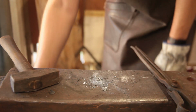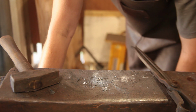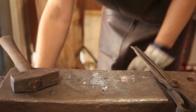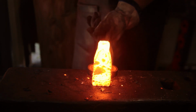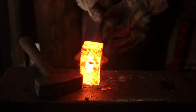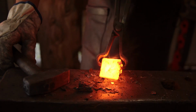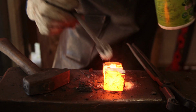Okay, for this style of weld, because it's so unstable, I am going to baby it and hope it takes. This one has been a struggle. The hoop welded up nicely. Just not sure why the 4140 is not taking. Usually it takes first go. Looking a little more promising. That's it, it just went, it just popped. There may have been enough residual heat.